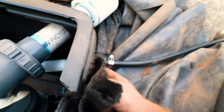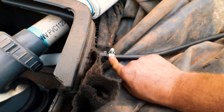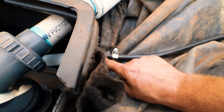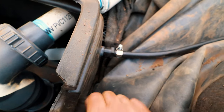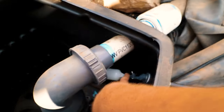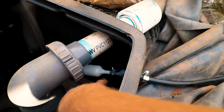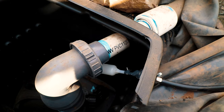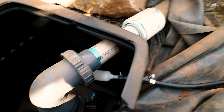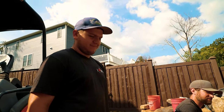This is Aquascape's compact autofill. We've got it drilled right through the side of the vault, hooked up to half-inch irrigation pipe. The kit included the necessary hose clamp and barb fitting that screws onto the back. I did use some silicone to make a nice watertight seal between the two pieces. I'll be adjusting it a little bit lower than where max water level will be — that allows for water in motion, so when the pump shuts off it won't overflow the basin. It will always keep just the right amount of water in here.